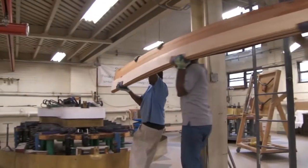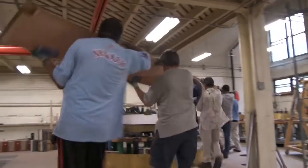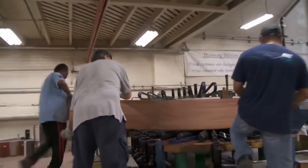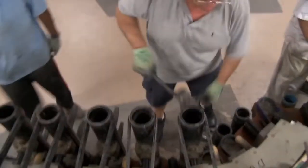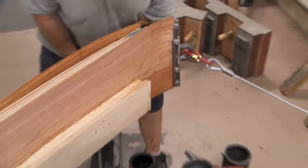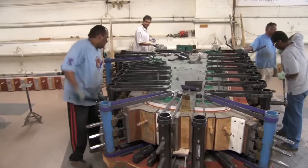The sets of maple, about 20 feet long, are carried to the press and clamped into position. The press, an invention of C.F. Theodore Steinway, was patented in 1880. Workers tighten the clamps working around from the center outwards. What results is a homogeneous foundation of unified inner and outer rim, capable of standing the tremendous tensions of stringing.